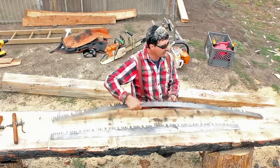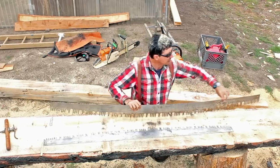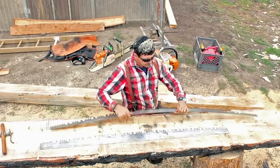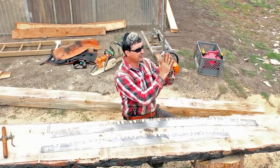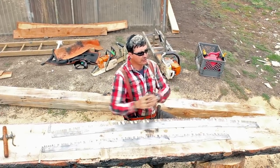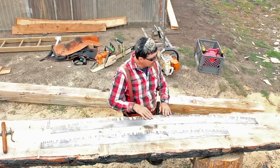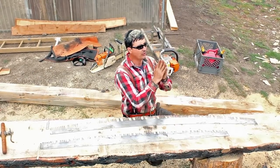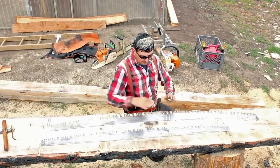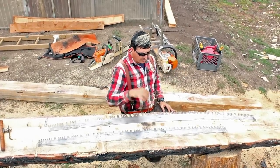Why is that important? When the saw is working in the kerf, because it's so much skinnier in the back and at the ends where the handles connect, the teeth don't need a lot of set. Any saw that cuts needs teeth sticking out wider than the body — if they're the same thickness, the saw will bind after an inch or two. An Atkins 53 with this fantastic crescent grind only needs two to three thousandths of set, so it cuts like a laser beam through the wood.